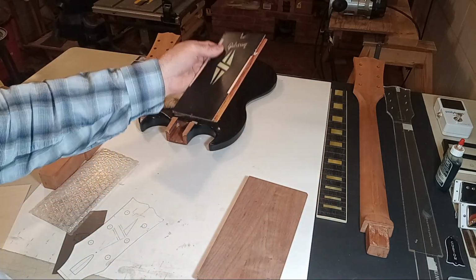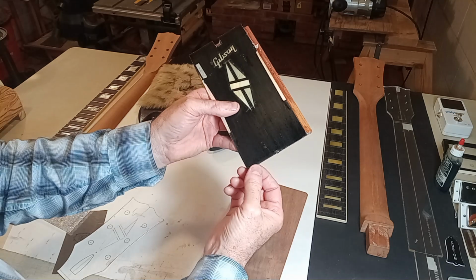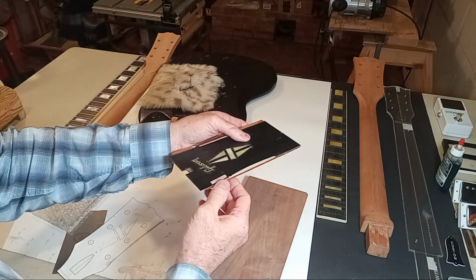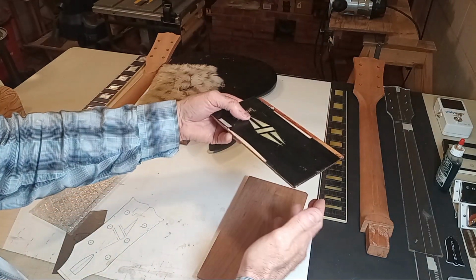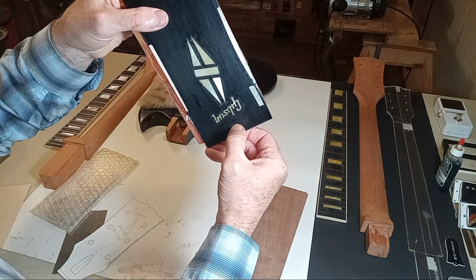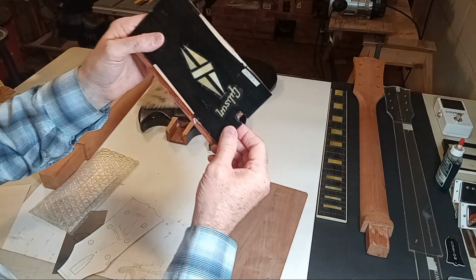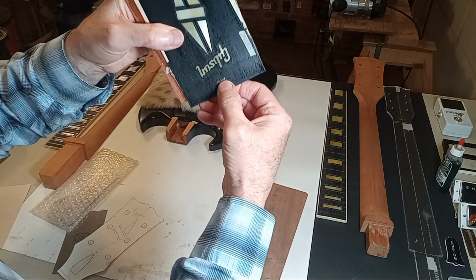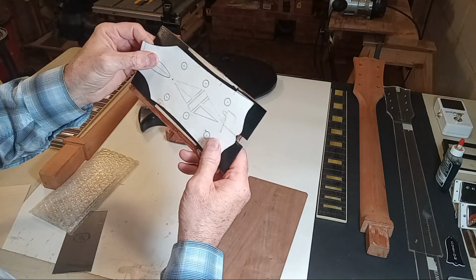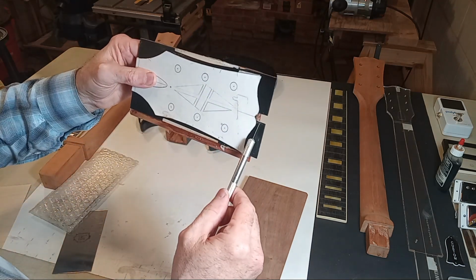Now I'm ready to go over to my miter saw and just ease a little bit of length off here and square that up with this back wall back here. Flip it around, and start cleaning that end off back up to a predetermined point that I punched through with a perforated punch like I showed you in the first video. So I know that if I went over there with my miter saw and tried to cut all the way up to that point right there, it would be game over, because that point goes beyond the highest point or the peak of the open book. So you would only want to trim off a little bit up here.